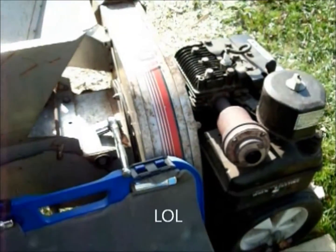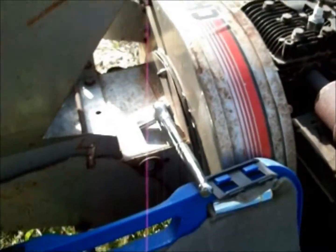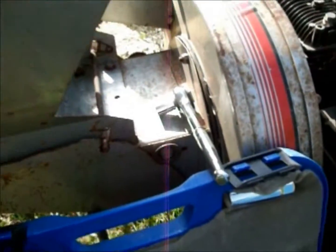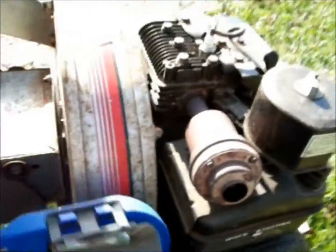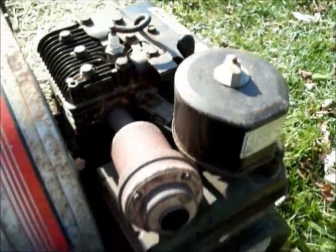Oh, yeah, the chipper. We're having a great day here today. We jammed up the wood chipper, so now we're going to take it apart and fix it. Start with these 4 bolts, which hold everything on. Socket drive, a 1/2-inch socket, and we're going to take those 4 bolts off. Jonathan will be back in a minute and hold the camera so that I can actually get at the socket here.